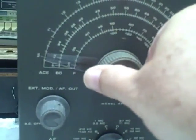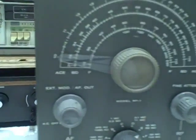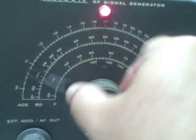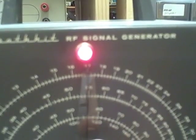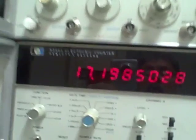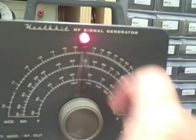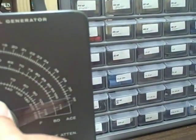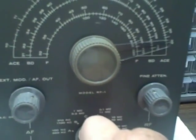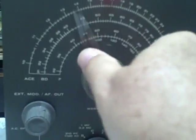Band E is on the outer ring. At the low end, approximately 10 on the dial, we are reading 9.988 — very close. Taking this up to mid band at approximately 17, we are reading 17.2 — very close. Full scale should be 32, and we are reading 32 — perfect.